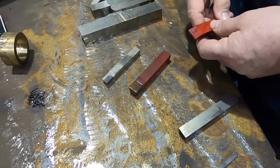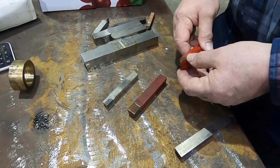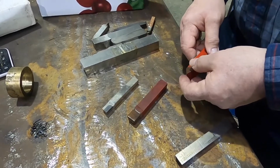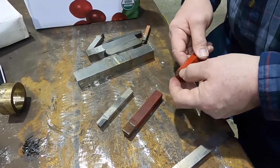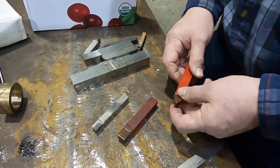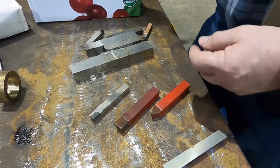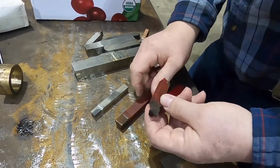But generally, when you're using tools like this, you take your new ones and you do your minimum grinding on these. Don't try and save yourself the extra. Use your used ones for what you can. I don't think I brought much. Here's one used carbide over here.